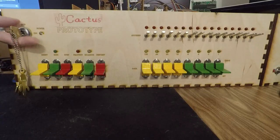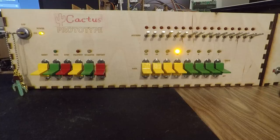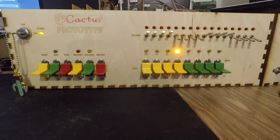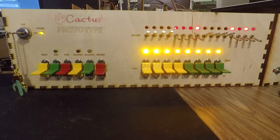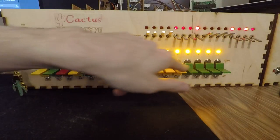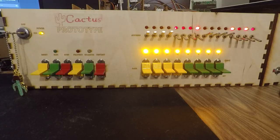Alright, so let's turn it on and play with it. Right now it defaults to run mode, so I always have to tell it no halt — that'll be changed soon enough. Let's see about visiting an address and seeing what's there. We're starting at address zero, but let's see what's going on higher up. Let's try 0F, 0F. Bring it up for examine — sure enough, we can see that the lights now match what the switches are at, and we can see some values on that address on the data bus.